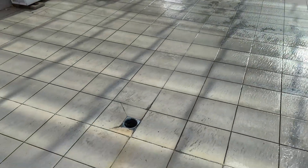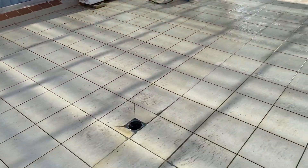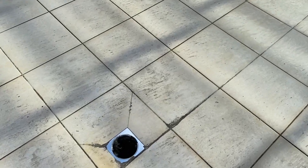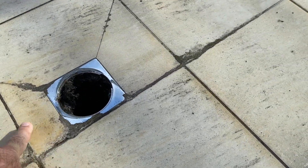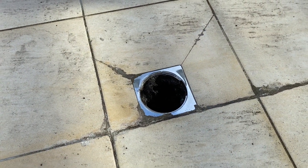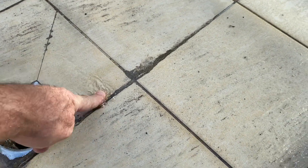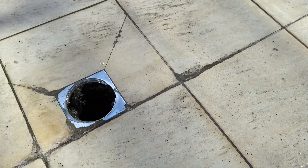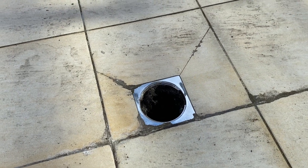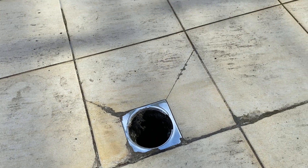I've done a flow test on the balcony and on the exposed area under the pergola. After about 15 minutes there's some slight pooling around the floor waste. That floor waste could be lowered with that tile to reduce the pooling, although the pooling probably doesn't breach non-compliance. It would benefit from lowering those two tiles around that floor waste to stop the pooling.